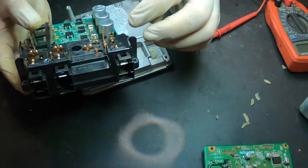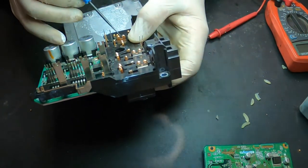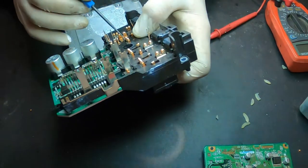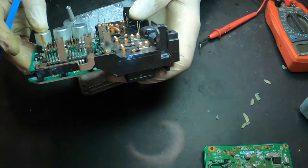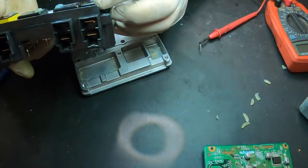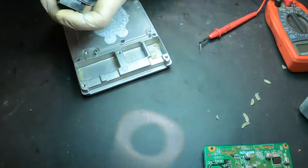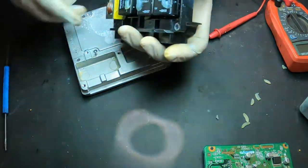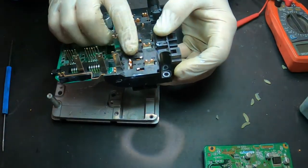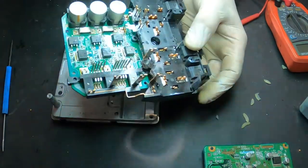As I can see, these are the switched power and this is the bridge. This is coming from the car going to here, and this one going here. I'm going to cut all these pins so I can solder them back afterwards and check which relay has gone. Let me see if the cover comes off — sometimes on these relays the cover doesn't come out anyway.